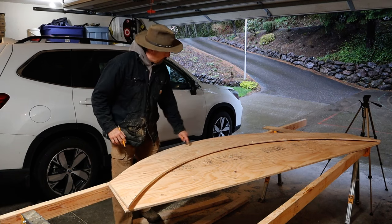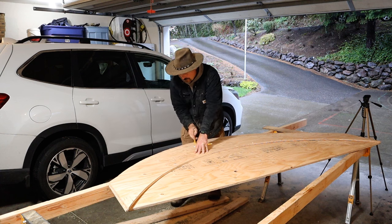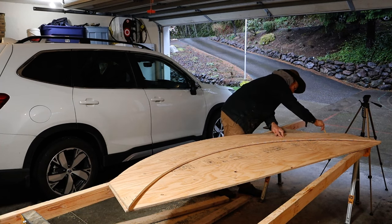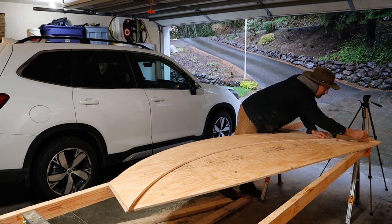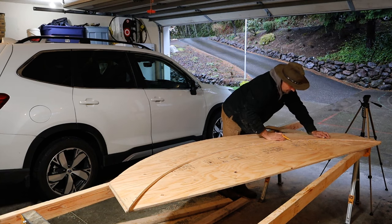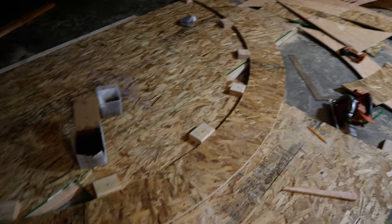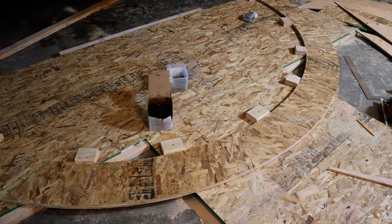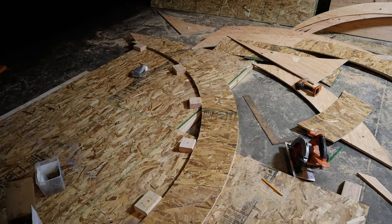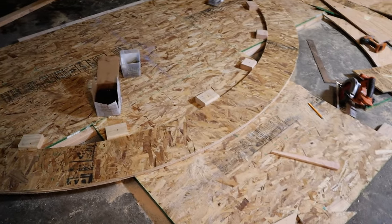Obviously, due to the radius being tighter on the bottom and top, there's going to be a little bit of waste — you can't just stack one arch right on top of the other. I created a jig to fit the pieces in. I've got two plies glued together. I thought about doing all four plies at once, but moving them around without jostling was too hard. So I put one ply on top of the other, put some glue down, screwed it down, and I'll take the screws out tomorrow, put two more plies on top, glue and screw it down permanently.